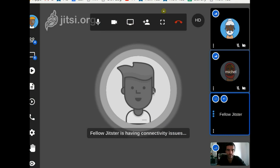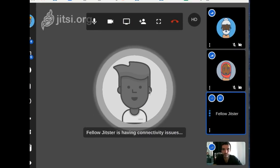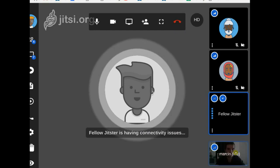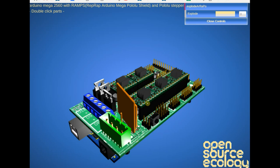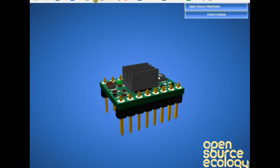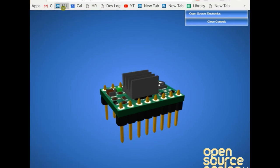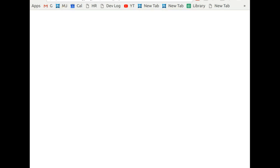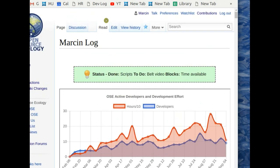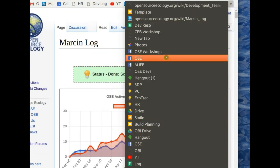Basically, this is smaller than what I assumed, so the accuracy can get better if we have a smaller size. So basically, we're talking about a differential drive tractor, right? So each side will be driven independently, right? That's correct, yeah. Okay, awesome. So this will make the turning part very easy, and we can do the turning very accurately with the Z-axis gyroscope built in over the tractor. And we can make it follow a certain trajectory with that marker being on the ground.